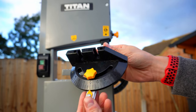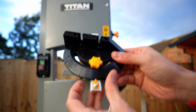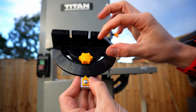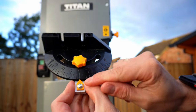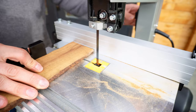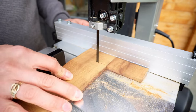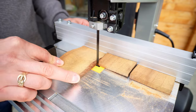As for the miter gauge, this is a fairly cheap miter gauge — it doesn't have any grooves that control the actual degree it's set to, so you are relying on a manual set square to make sure you've got it set to perfect zero. I do encourage people to check that every time. What I've really enjoyed doing is combining this miter gauge alongside the fence to cut repetitive cuts with small pieces of timber.